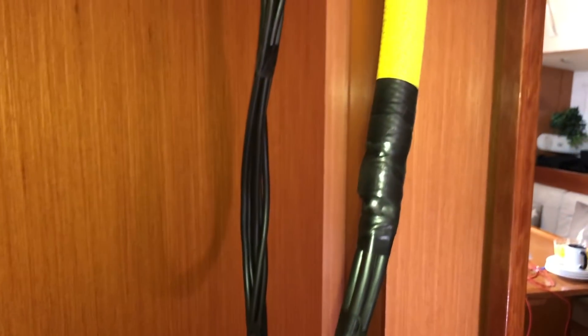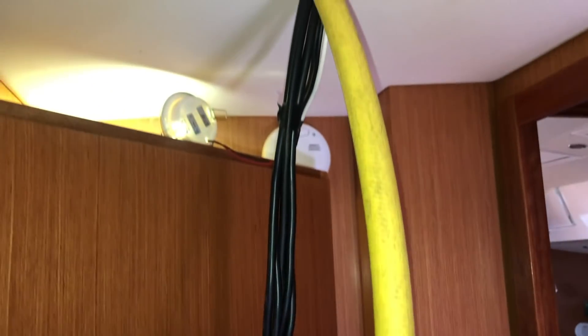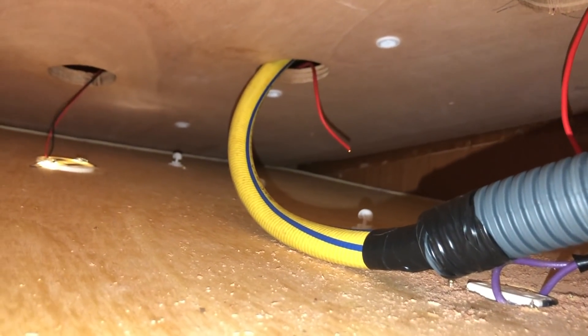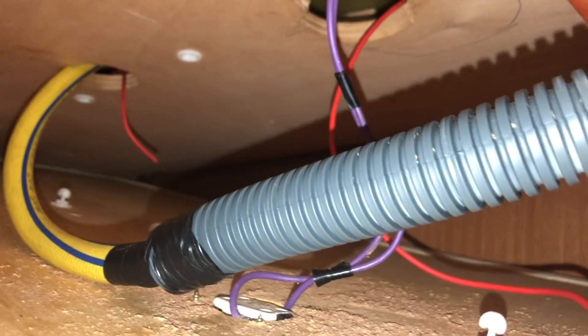However, from the galley via my walk-in closet it was tricky and my guiding cable didn't do the job. I had to be pretty creative — using the holes as a guide, I could tape the flex tube and twist and trick it around the corner via the holes in the roof. Using cables and an aluminium stick to get the holes in position took me the entire day, fiddling between fiberglass-reinforced walls and double roof layers. Using my iPhone video function with light inside the compartment helped me understand how to get around and control that I was on the right track in places I could only get my hand into. As weird as it sounds, using this hose was my best idea this week and it worked perfectly for the job.